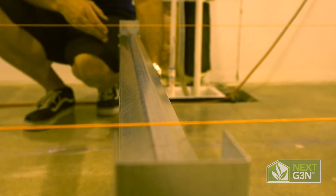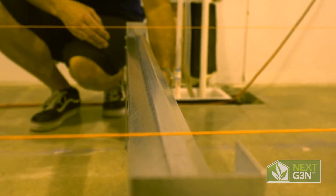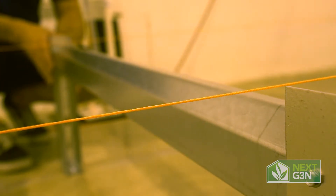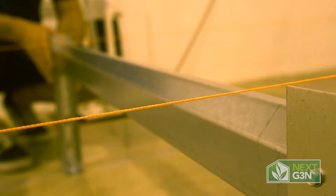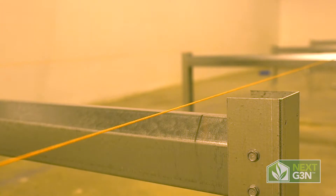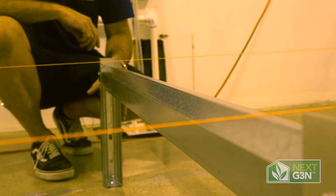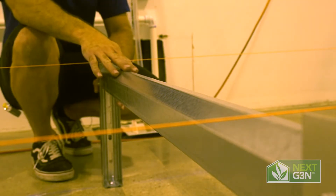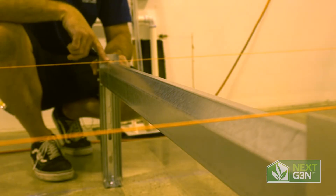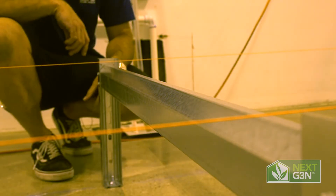We don't put the hardware in yet because depending on the position, your bolt holes may change. Maintaining this gap is important as we move along because we don't want the string to be disturbed. When we do go to set our gap, we're going to bring the leg up to the string but not touching it — just leaving a little air gap. Using two strings rather than a single string down the middle lets us better keep the table level and check our work. We're going to have a level on it while we do it, bringing both sides up almost to the string, fastening the leg, and moving on to the next one.